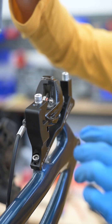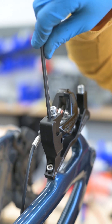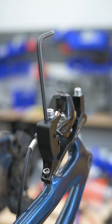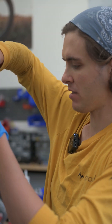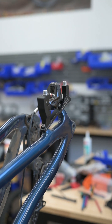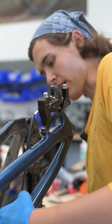The elevate mount includes this hole so that way if you need to work on your brake — disconnecting it, bleeding it, centering it, or if it's rubbing on your rotor in the future — you still have access to it without needing to fully disassemble. Once we've got that in place, we can go ahead and tighten back down the cable stops.